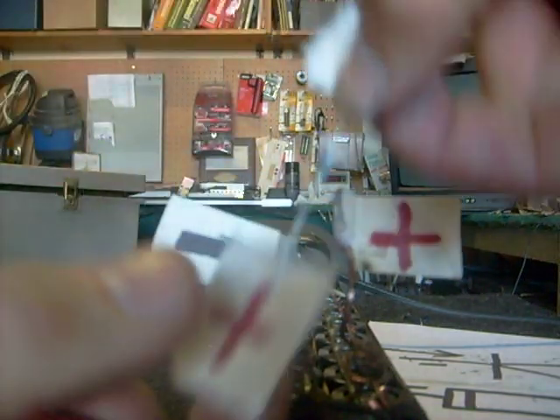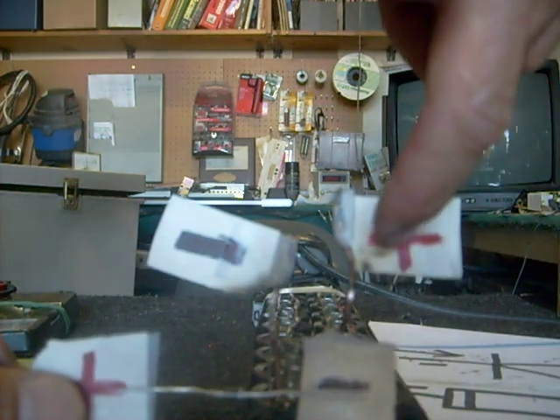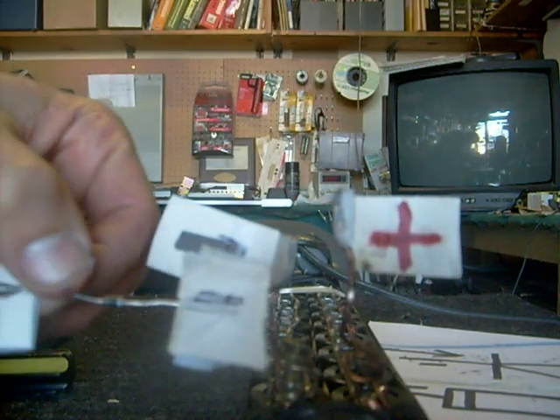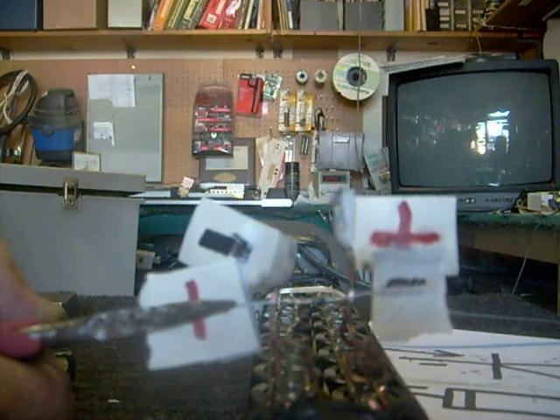First, I'm going to turn this diode around — I've got it marked so you can better understand what's happening. This is a positive terminal here, this is a negative terminal, at 200 volts. And I'm going to carefully hold this across these two terminals. And if my calculation is correct, absolutely nothing happens — that's because no energy flows in this direction.